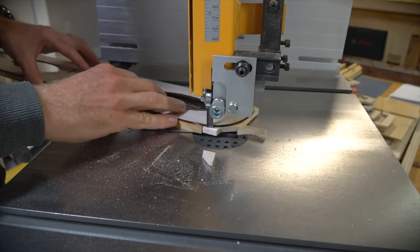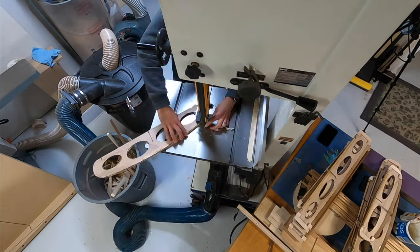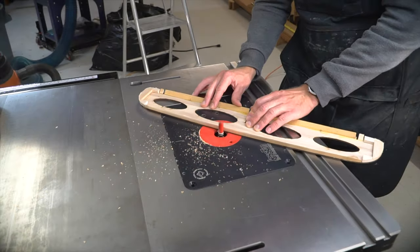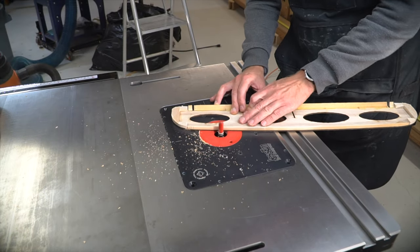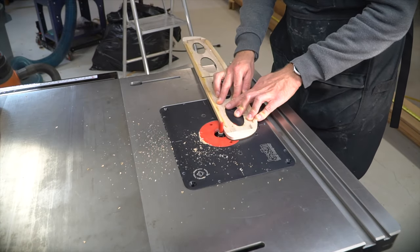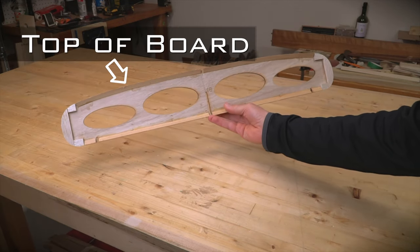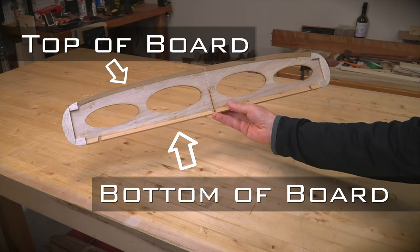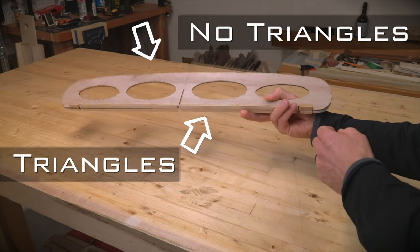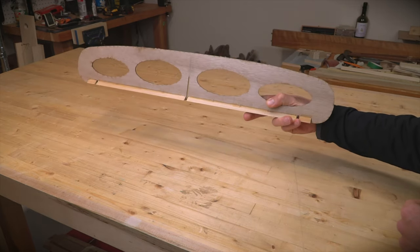Remember how I wasn't too picky about lining up the edges? Here's where that gets fixed. A quick pass with the bandsaw got the edges close to flush with the frames, and then a quick lap of each frame with the flush cut router bit took care of the rest of the overhang. You'd notice that there are only glue strips on one side of the frame at this point. To save some time and additional headache, I decided to keep it this way for the deck, and only continue with adding triangles to the other side of the frame for the bottom part of the board. The board is built deck first, and then flipped over later on to complete the bottom. With the board flipped and the bottom still open, I plan to add a small epoxy fillet between the frame and the deck skin to really ensure that it never comes apart.